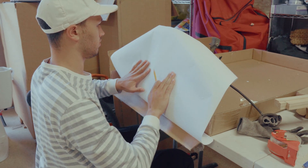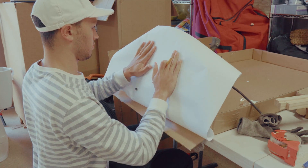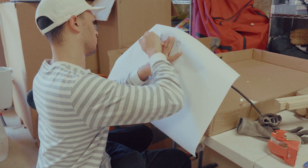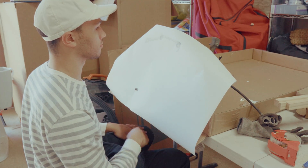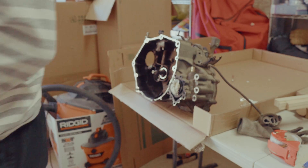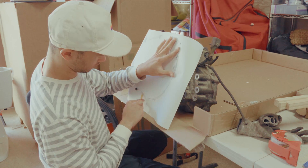This next technique is the most interesting and the oldest — it's called a rubbing. This is a technique that machinists have used for a long time to make gaskets or adapter plates, just like what I'm doing here. You take a piece of big butcher paper and a pencil and act like you're back in kindergarten. The paper tends to move, which is a problem, so I tore that one up and tried again. On my second attempt I was able to keep the paper much more still and get an accurate tracing. Finally, I had something I could work off of.